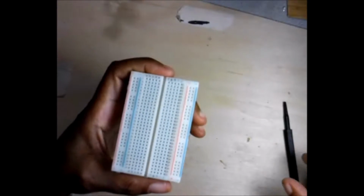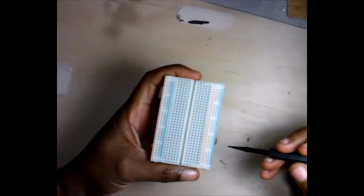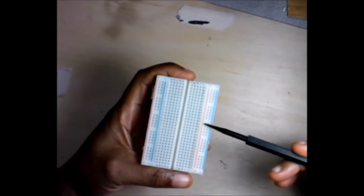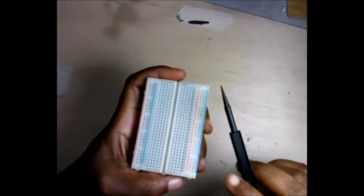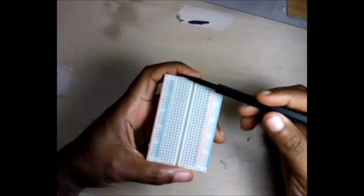Let's go ahead and explain the breadboard. Okay, so with the breadboard, just making sure we can be seen here. With this breadboard, and this is pretty much the way they're all set up. Like I said, the one that I had from Radio Shack actually has separated rails, and in that case you just have to keep in mind that you have to jump over power to the other section if you want that other section to have power. These have continuous power rails because they're so small.